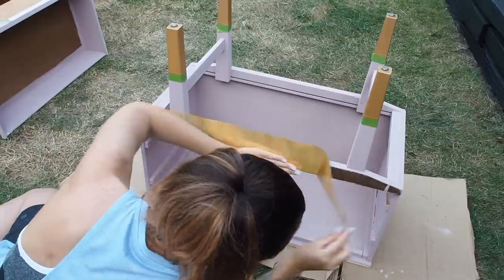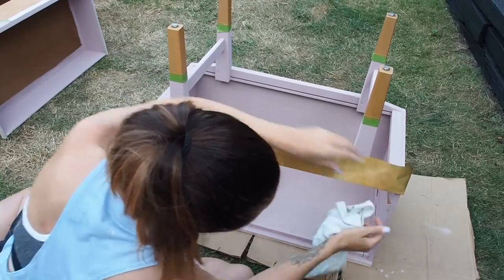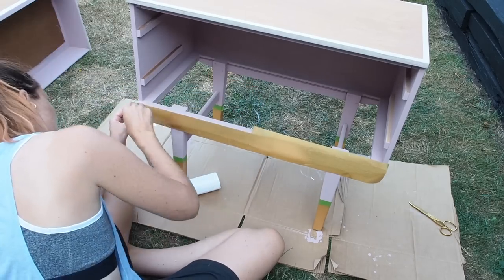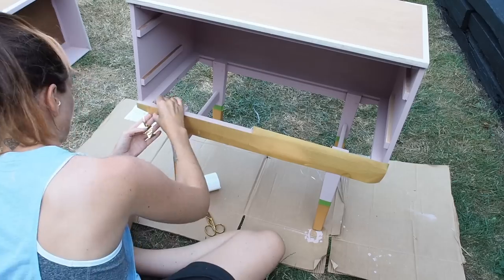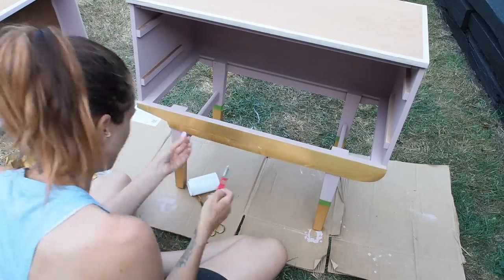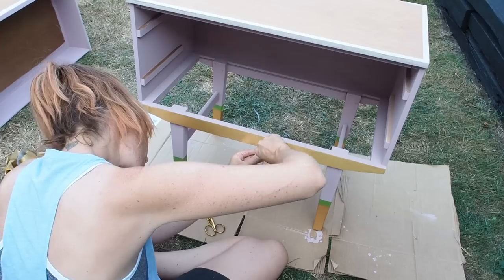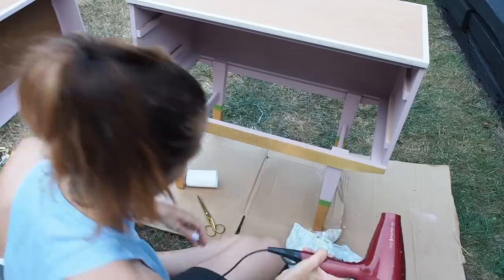The veneer section had some areas of damage that were quite bad and deep, so I had to filler them to make it nice and smooth, then I covered that whole section with the gold foil so it looks like a metal section of the unit. I cut a piece approximately to size, lined it up with an overlap on both sides, smoothed it on all the way along, then trimmed off the excess with a scalpel or Stanley knife. I also used a little bit of heat with a towel to really smooth it out and make sure it was perfect.